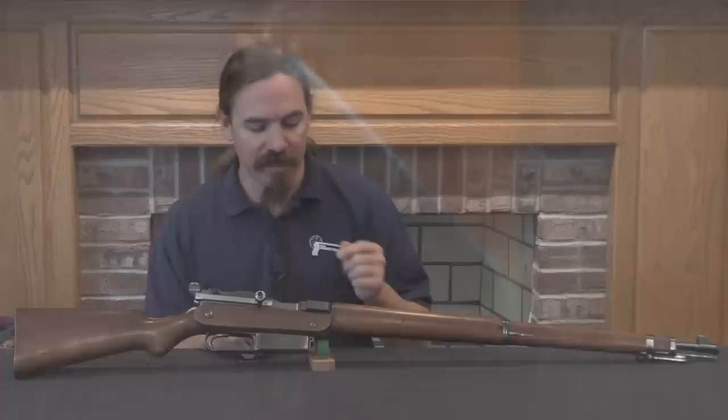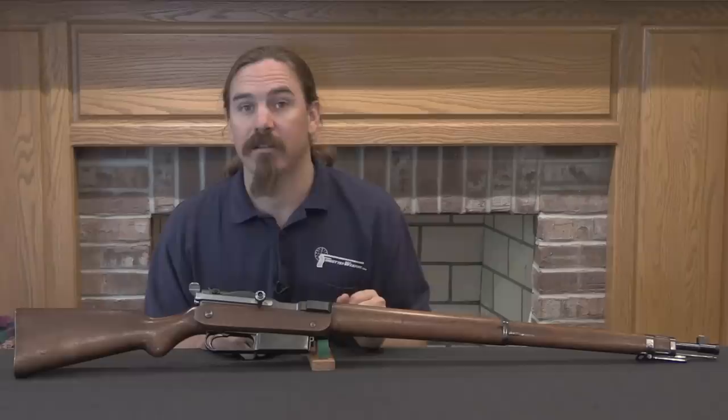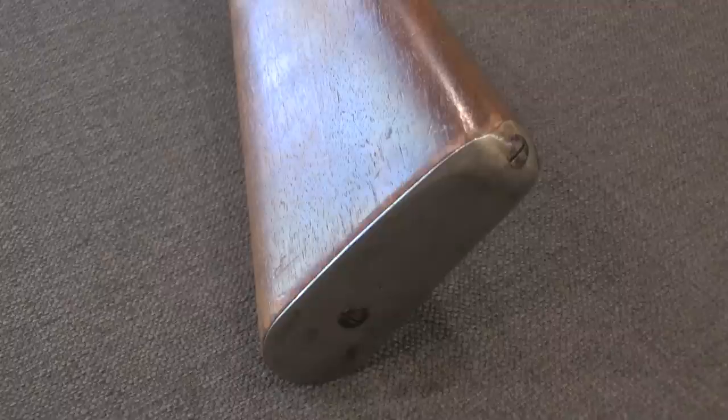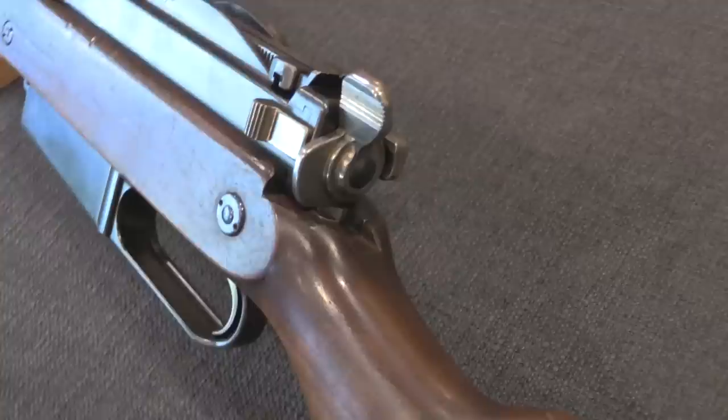Now this is a flapper locking system, and what's really cool is we can see — it's very clear from the outside exactly how this works. I should point out: when one of these exploded on Mauser, as far as I can tell it wasn't actually a detonation of the rifle. The action didn't fail — what happened is he had an out-of-battery malfunction. One of the cartridges detonated when it was not fully seated and locked, and apparently this had a serious impact on Mauser's view of rifle safety.